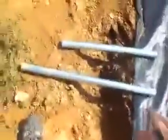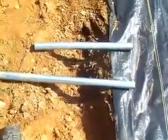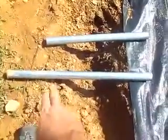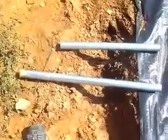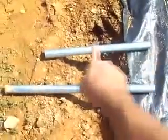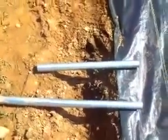I wanted to show you what I did on the front here. This long piece is 3 pieces out of one 8-foot piece of post. On this front I used long pieces — I put about 2 of those on each end and concreted them in just a little bit deeper, because they are going to catch the wind so bad I don't want it flying off like a kite. The other smaller posts I cut into 2-foot pieces — 4 pieces out of one 8-foot piece — and I did the rest of the greenhouse with those.